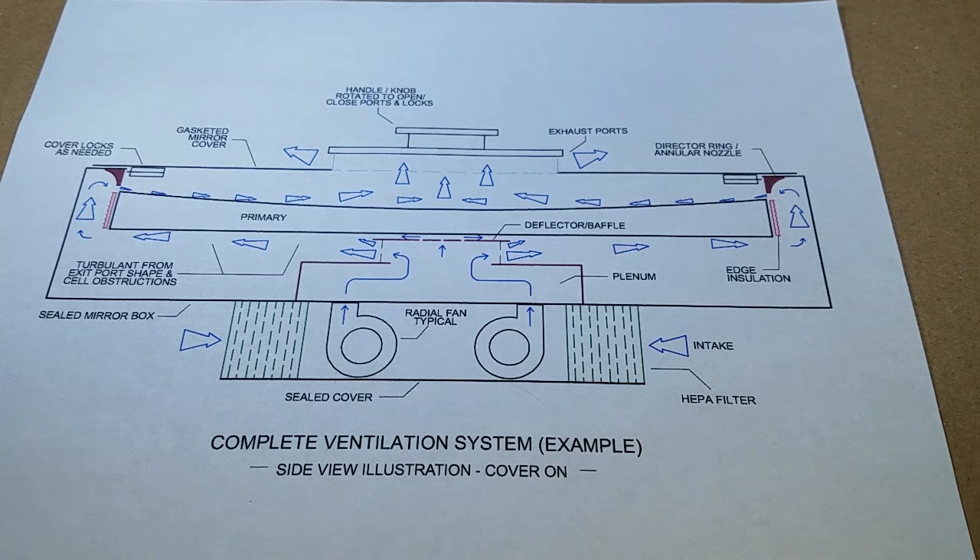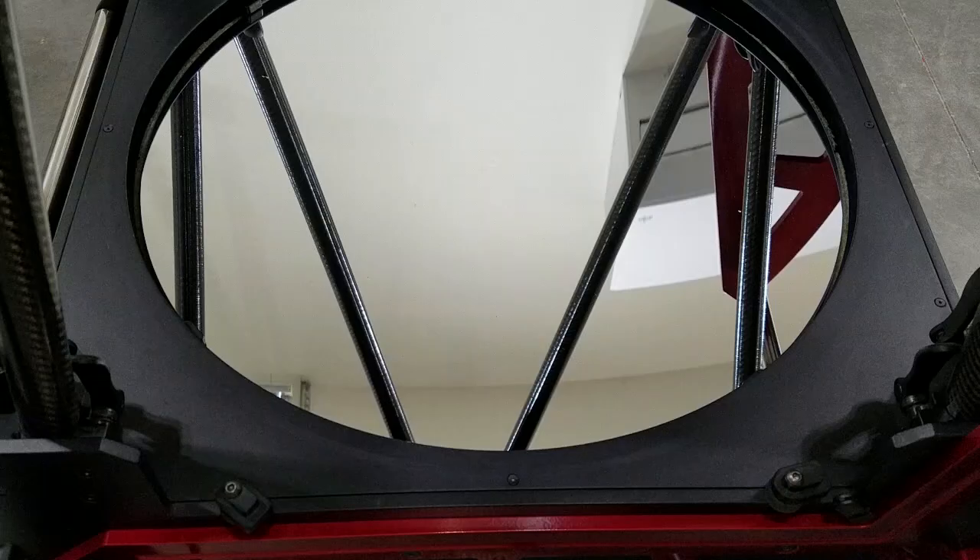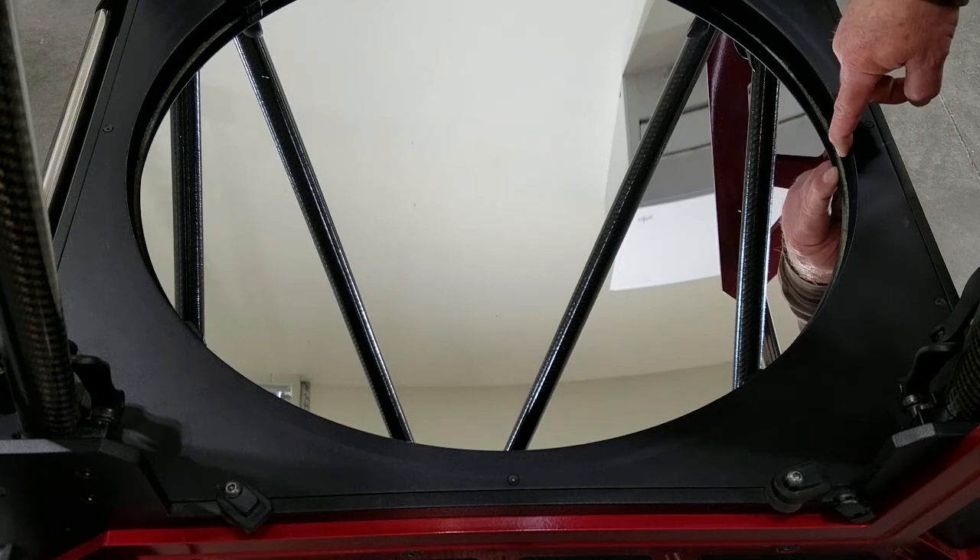This diagram is the same as before but with the mirror cover on. Note that the airflow pattern in the box and above the mirror is identical whether the cover is on or not — this illustrates why it's important to exhaust the air from above the center of the mirror and not the side. A bird's-eye perspective above the mirror uses arrows to indicate general velocity of the air, with regions marked laminar, transitional, and turbulent to be discussed more shortly. This is the location of the director ring.